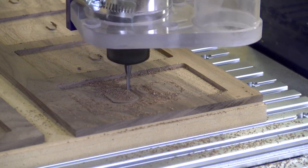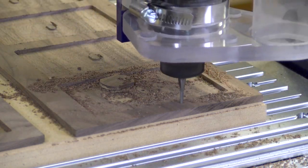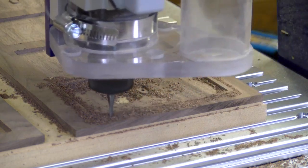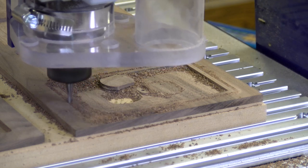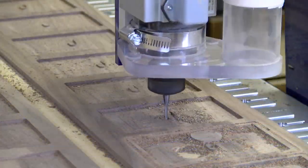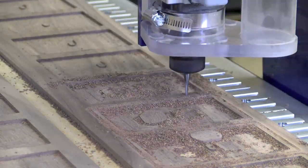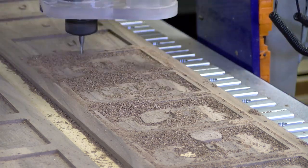We are pretty aggressive with this small 1/8 inch end mill, but all the confidence and production value come into your speeds and feeds. You want the bit to actually make a chip instead of just turning all the material into dust. If you run the machine as fast as you can, your bit will rub and cause it to wear out and degrade much faster. If your bit actually takes a bite out of the material and makes a chip, you are going to be able to push your speeds and increase your profit margins.